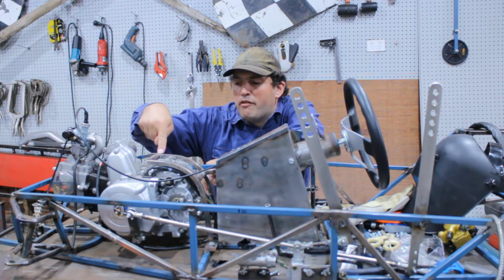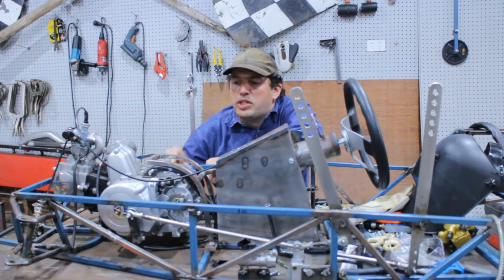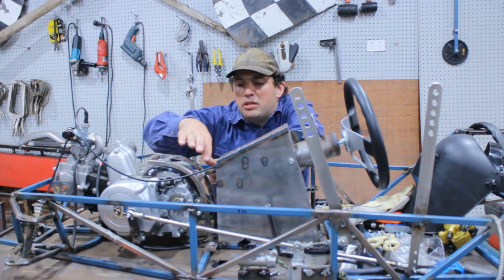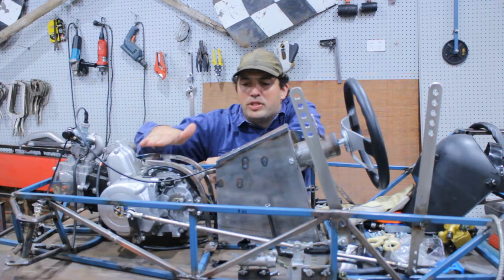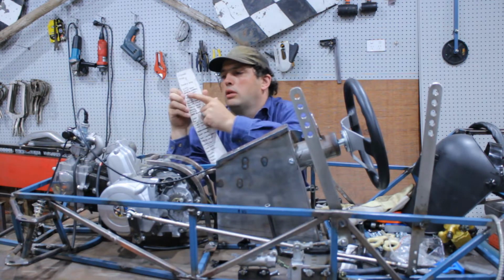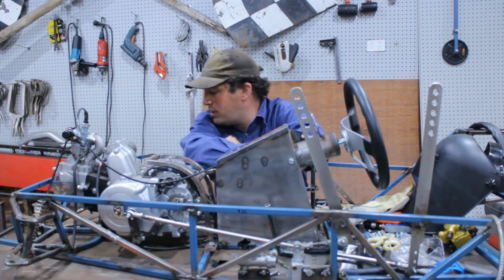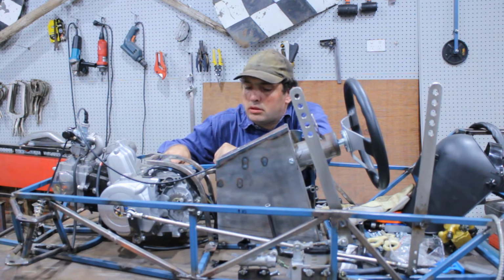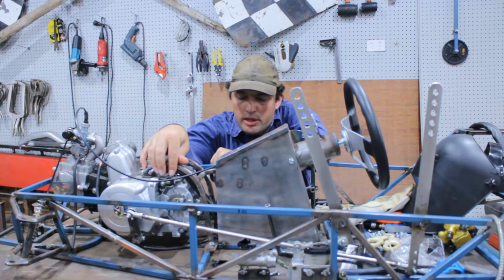All I have to do is bring a bar from this side here down to the side of the chassis, just a single bar. It's not a load supporting bar because it's supporting the load on these and at the front. It's just to stop it moving sideways. So, engine cradle is on the list, so that's something that needs to be fixed. So we'll put this extra bar in, weld in all the nuts for the engine cradle to bolt down to the chassis with.